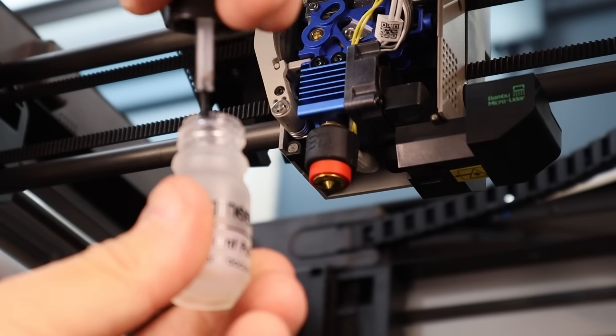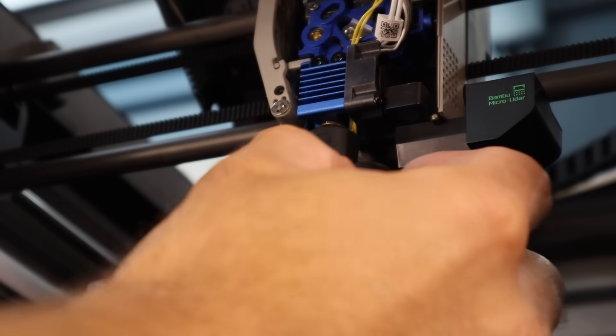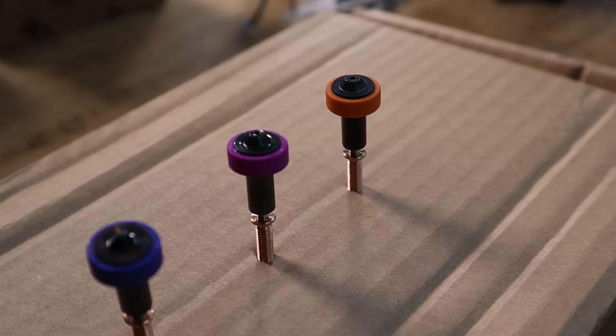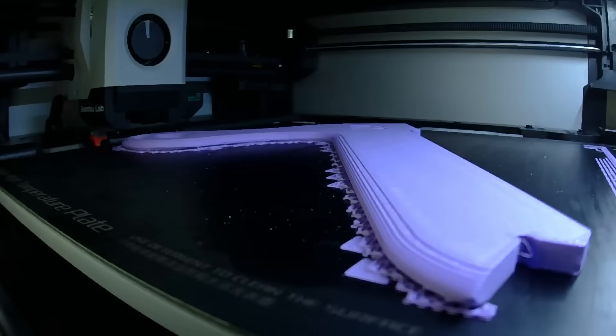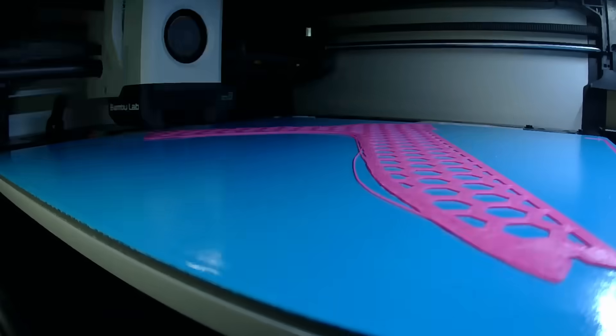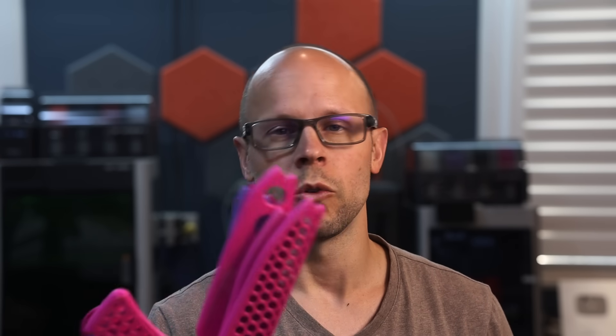I'm going to apply the plastic repellent. I normally print with higher temperature materials, so occasionally I'll forget to open the door when printing with PLA and end up getting a nozzle clog from heat creep — that happened a few times with the Slice Mako even with the new aluminum fan. So it's a pretty big bonus to have prints finish without worrying about it. To test the Revo on this, I printed each of these push sticks from Basic PLA with the door closed, and I ended up having no problems at all with heat creep or nozzle clogs. This design is much better at preventing heat creep.